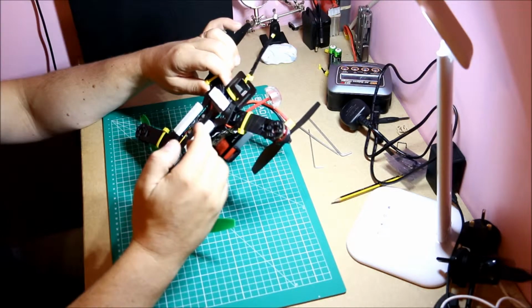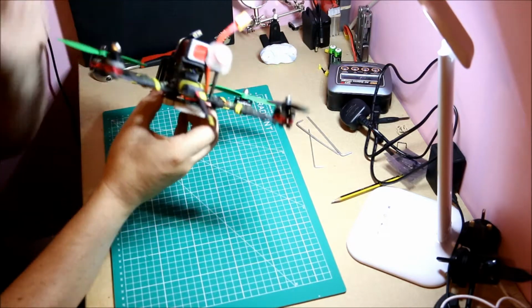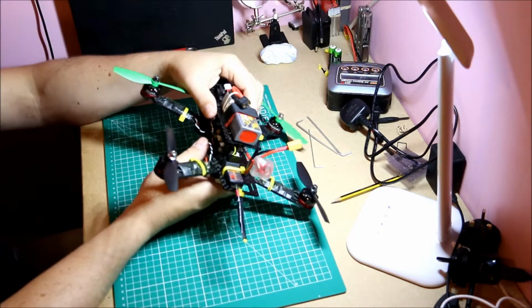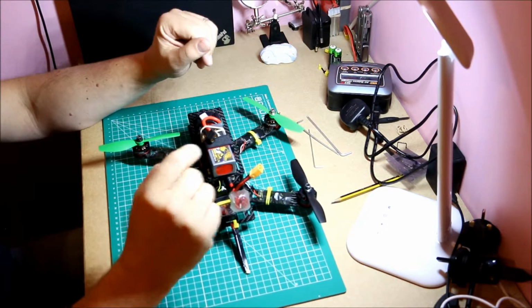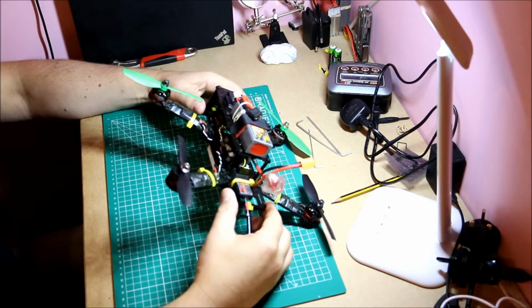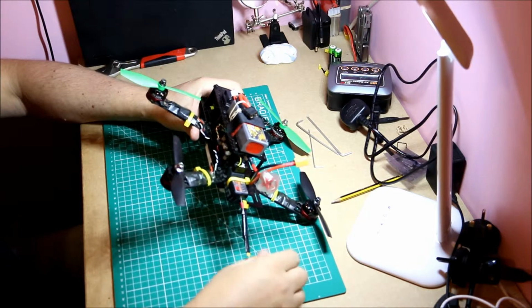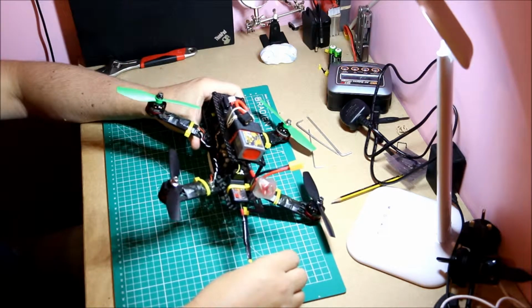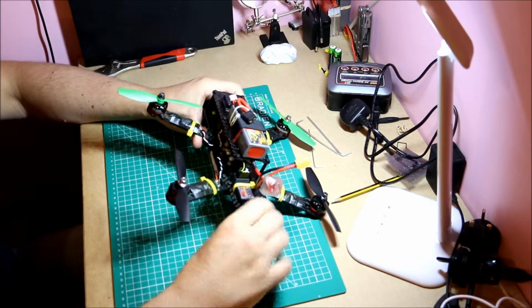And then of course there's a couple of other things that you want to plug. You can get 5 volts from the power distribution board to run your F3 type flight controller. If you have certain types of F4, they don't need 5 volts, they'll run off the battery power, but you need to make sure which type you have. So the SP Racing F3, fantastic flight controller, will run Cleanflight, Betaflight, very simple to program. There's a deluxe and an acro version.